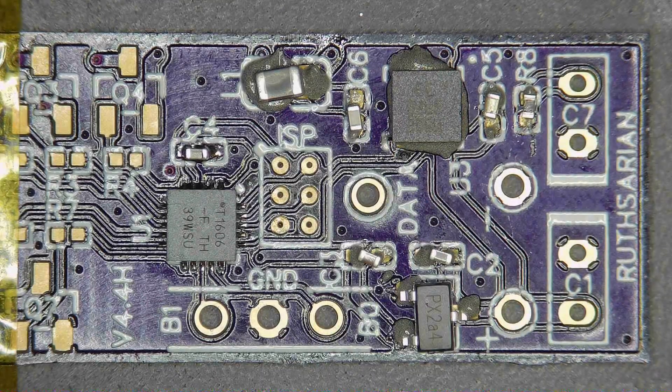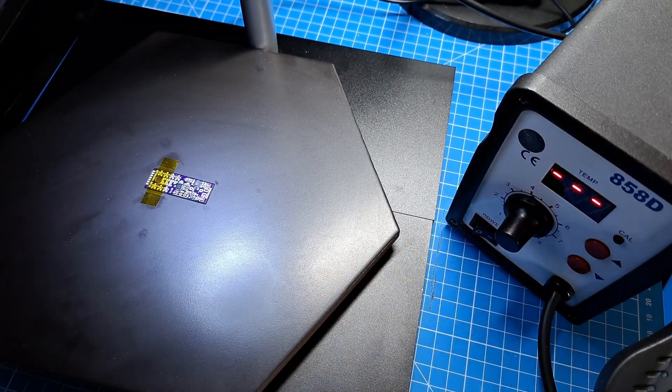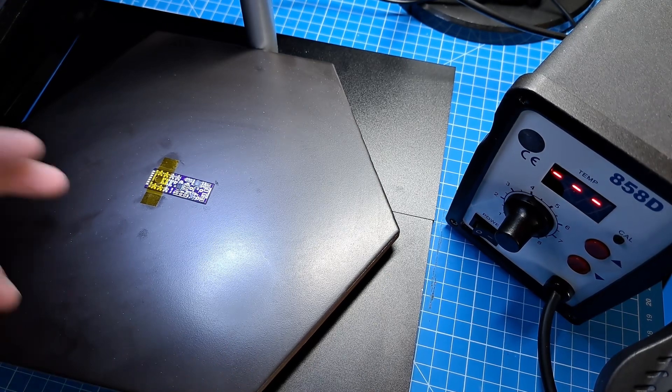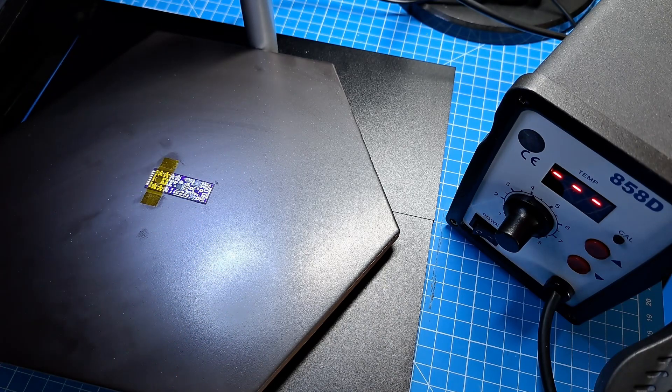C6 looks like it's lopsided to one side in terms of position; C3 as well. We could adjust those, but I'm actually going to leave them like that just so we can see the magic of hot air. So back to reflow now. I'm going to start out again at about a 4 on the nozzle speed — the air speed coming out. It's going to take about a minute to two minutes to warm up the board and the tile and all of that stuff, and then once everything's warmed up you'll start to notice the solder paste will sort of lose its gloss. I will probably at that point increase the speed to about a 5 or a 6 maybe, and that should finish the process and get everything flowing.